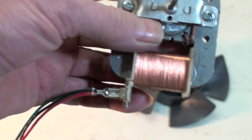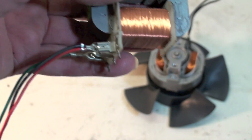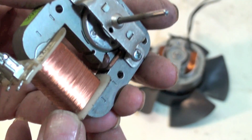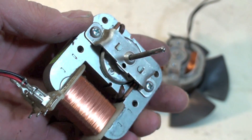There's one winding and that's this right here. This one is actually two speed — you can see you've got three terminals there, they've only got two of them hooked up. I'm not sure how they got that set up, but this could actually be operated at two different speeds.